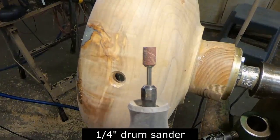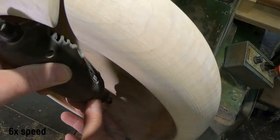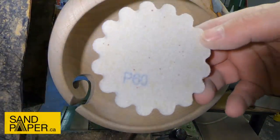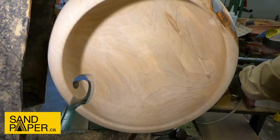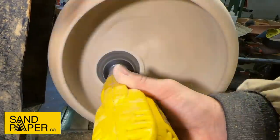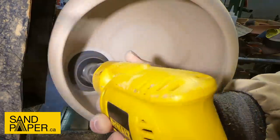This is a little quarter-inch drum sander that goes in my Dremel tool — it's a handy little rig to have. Again, lots of sanding starting with 80 grit to 320. These discs are three-and-a-half inch nipple discs from sandpaper.ca — there's a link in the description for 10% off your next order using code INLAIDJIM at checkout. I really like these nipple discs because they fold around the edge of the sanding pad and you get less dig-ins. The sanding pad I'm using also comes from there.